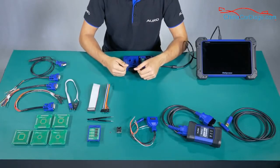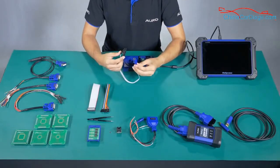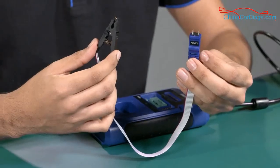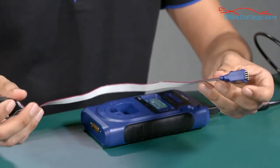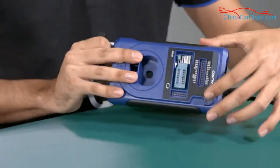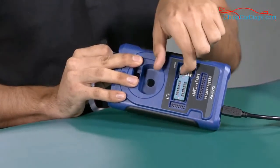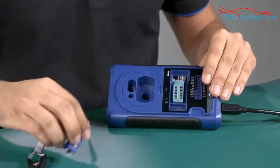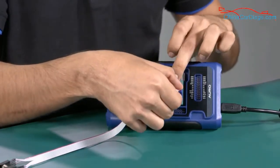Number 6: APAV103. These clamps are used to read the EPROM information directly from the module, which means we don't need to remove the EPROM to put it on the board. To do the assembly, you need to make sure that the red lines match according to the red mark on the UP400. We unlock it and then put the red line in the correct orientation and secure it.